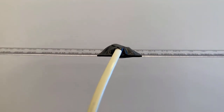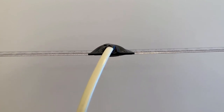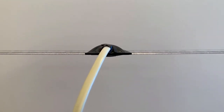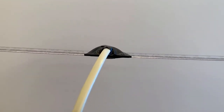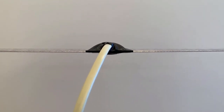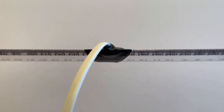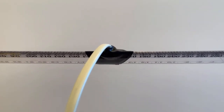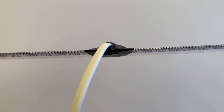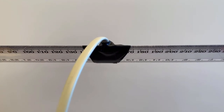Now I focus on the top side of the sensor. I point the top side of the sensor vertically and search around until SarkTrack stops beeping. Whenever I hear another beep, I stop and concentrate around that point. This is point number three complete. Next, I point the top side north at my local magnetic inclination and search around again until SarkTrack stops beeping. This is point number four complete.